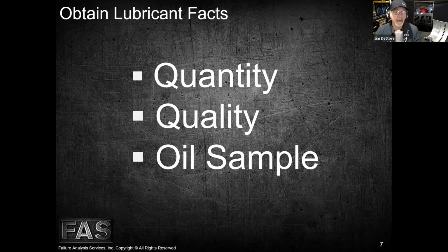Exactly, yeah. There's some systems out there or some units that run, and they sweeten the compressor, or excuse me, they sweeten the engine oil and they pull some of that engine oil off and they lubricate the compressor cylinders with it, right? And if that's happening, then there's a possibility. Talking with some of our customers, some of those are using 2, 3 gallons, 4 gallons of oil a day. Now, don't quote me on that number.